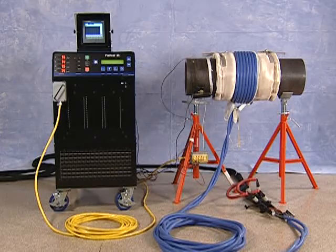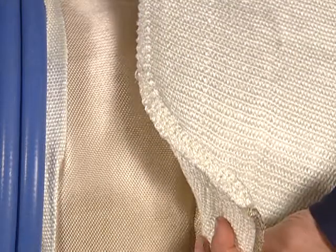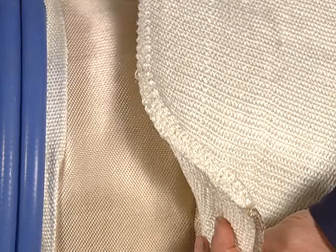The ProHeat can also be used for a hydrogen bakeout process, occurring between a preheat and post-weld treatment. The setup is the same for that used in a post-weld heat treatment. Typically, it's performed using the same half-inch insulation blanket as used in the preheat.